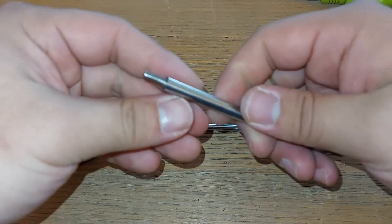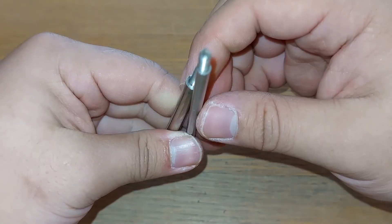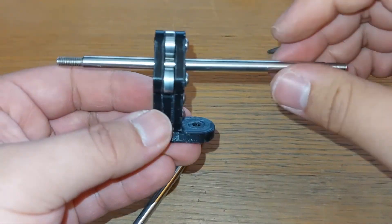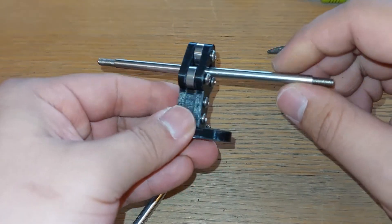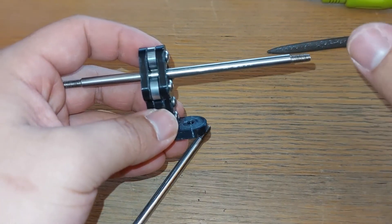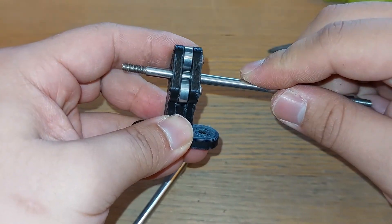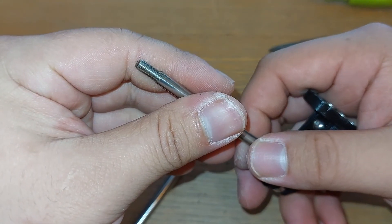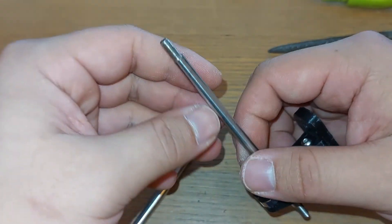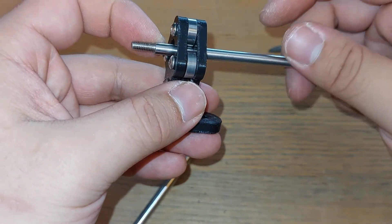Here are two links I made previously — a quarter inch link and a 3/16 stainless link, both solid and both M4. The 3/16 slides on nicely, doesn't come out, and spins well. There's still some wobble but it doesn't matter much as long as you have the chuck on one side. This is what I'm trying to avoid — without the carrier there's a huge wobble and the drill chuck isn't perfect, so this carrier makes the link spin a lot truer.